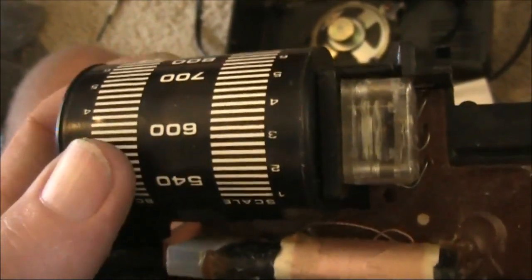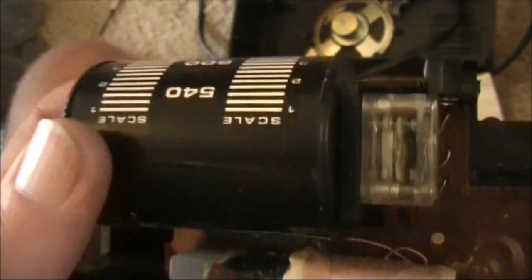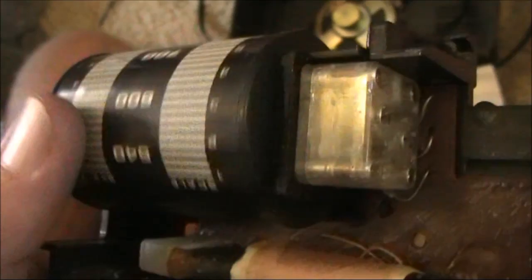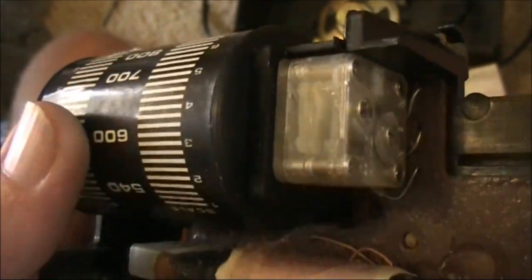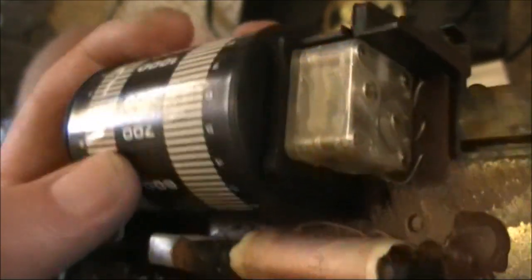Here's probably the main prize: the drum dial. Now the local oscillator, without modification, should operate on 160 metres. So you could even use it as is as the basis of a 160 metre direct conversion receiver. Or, if you've got a crystal set, I find that applying a bit of RF bias to it will improve its sensitivity, and you'll even be able to hear SSB and CW signals as if you're tuning on 160 metres with it.